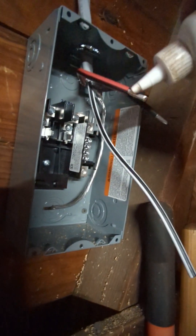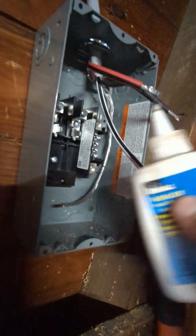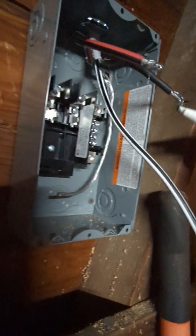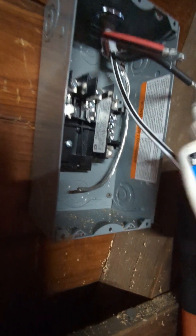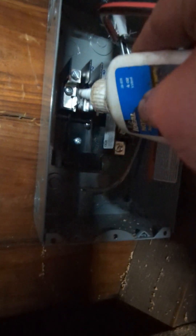I'm going to grease all my aluminum wires with no-lox before I put them in, and for extra credit I always put it on my bus bars too, right where my breakers stab on — in the holes, everywhere. Overkill it with the no-lox so your wiring doesn't start any fires.